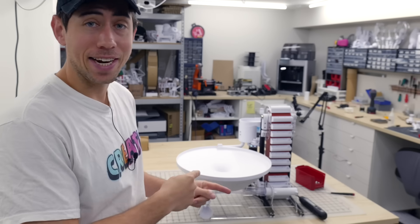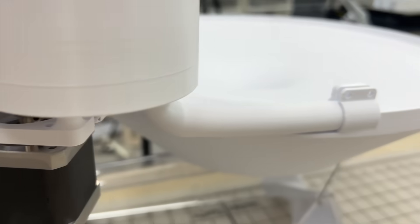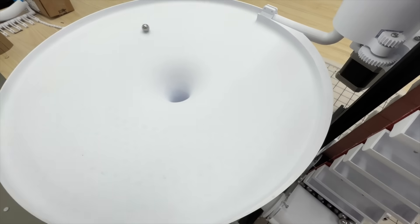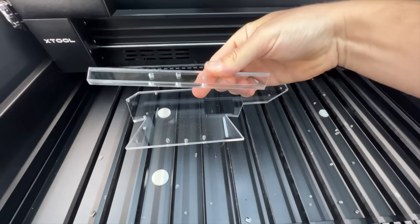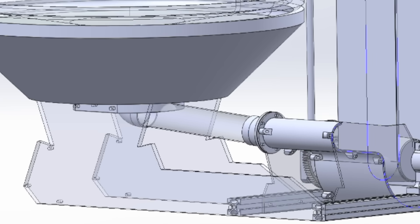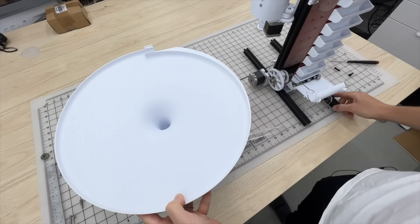The machine build is done and it went mostly smooth, but there's one small problem: the top ramp had to be lower than I was expecting, which means the hopper is lower, which means it doesn't have as much gravitational potential energy and the balls are just kind of popping out. Fortunately there's a pretty simple fix — I'm going to use a laser cutter to cut off the tops of the supports holding up the gravity well, moving everything down about 25 millimeters, and make a new exit tube that's flat rather than slanted. Hopefully that 25 millimeters is enough to give the balls a little bit more pizzazz on the gravity well.